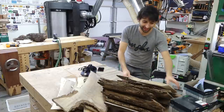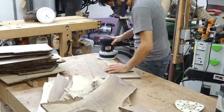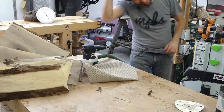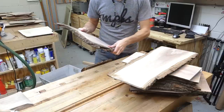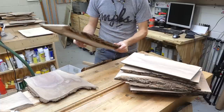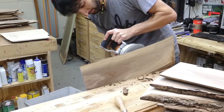That's really about it for construction, and from this point forward it's all finish prep and then finishing. The edges need to be prepped as well as the faces — I'm going to go through and do all the finish prep on the faces first, then address all of the edges. Some of the edges still have bark attached. Depending on how well the bark is attached I may leave some on there. For the walnut at least, I'll strip away the outer bark and leave the inner bark, which leaves a pretty cool pattern I really like. I'll use a drawknife to strip away the majority of the bark and blend it back in with a sander.